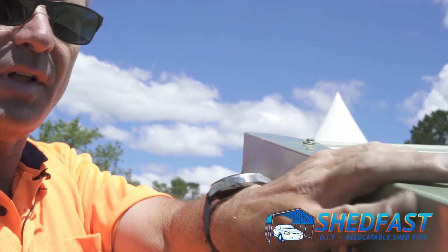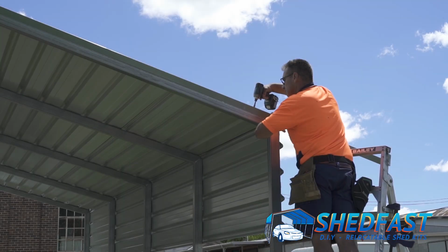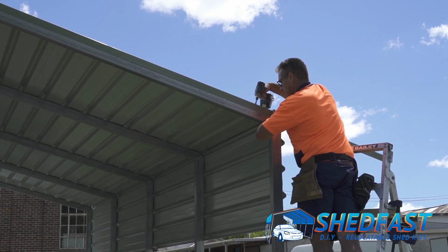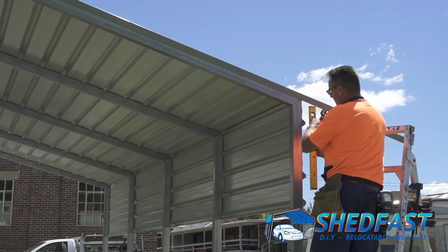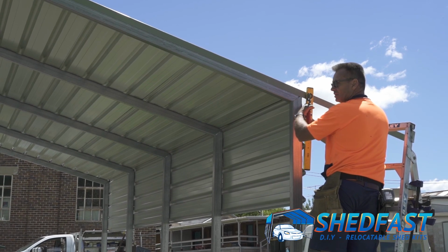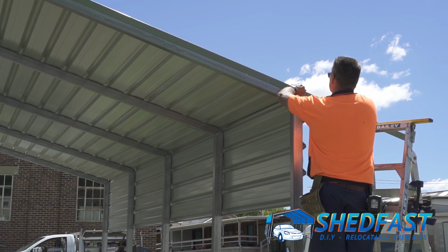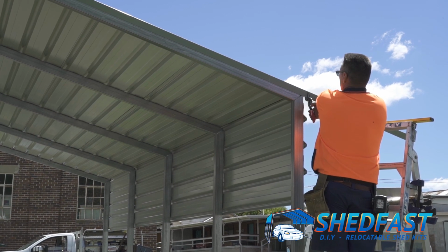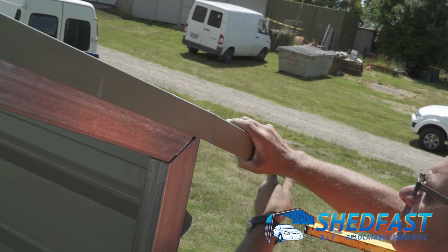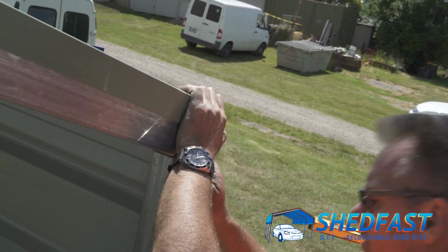The flashing has a protective plastic coating on it, which can actually be a little bit harder to get through, but it gives it a good protection. Again, with the straight edge, you're holding it onto the ribs, which gives you your outside edge, and that's what you mark at the top. So you can see the mark there, and that's where I'm going to cut. So support the outside a little bit there, cut it up, and then just ensuring that you're pulling this forward, peel it around, and straight down.